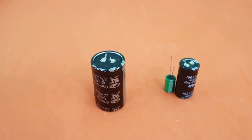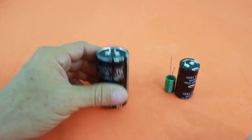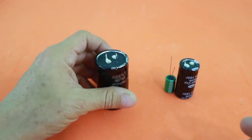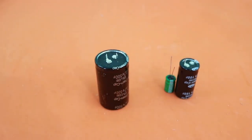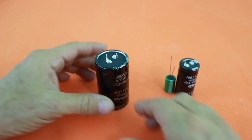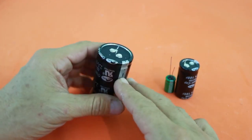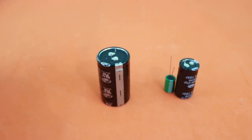One of the advantages of supercapacitors with respect to batteries is that you can charge them very, very quickly. A supercapacitor can be charged in less than one minute while a rechargeable battery takes about an hour to charge. And also you can discharge them very quickly — a supercapacitor can give you a lot of current while a battery is limited in the amount of current you can obtain from it.